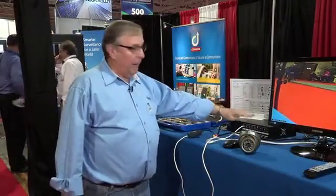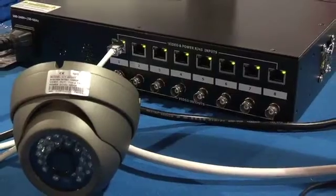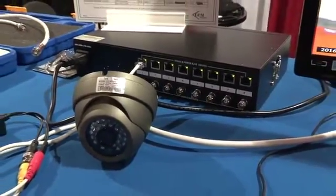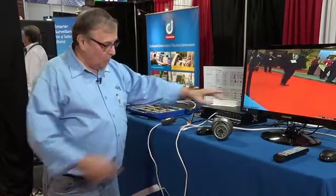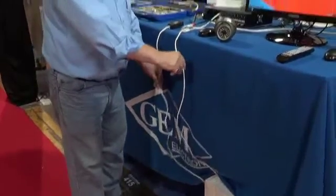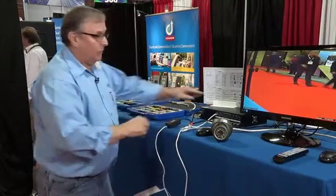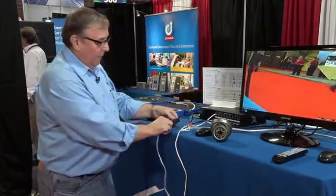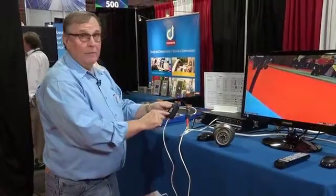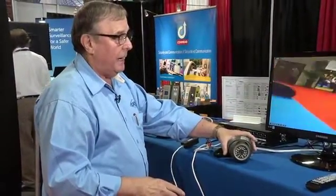I will cut and crimp at the same time. What I have here: I've got these in 4, 8, and 16 channel — this is a video power hub. What is very important is that there is a 36-volt power supply in it. So I'm running 500 feet at 36 volts over Cat5. At the camera end, I have a voltage-reducing adapter that brings it down to 12 volts so I can use this HDTVI camera.